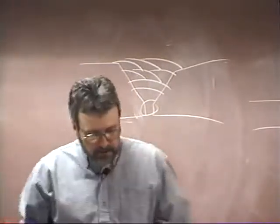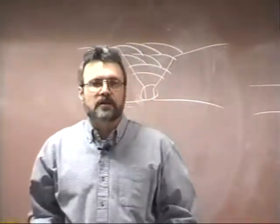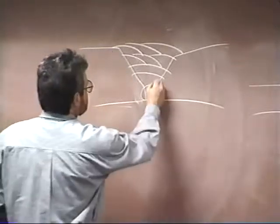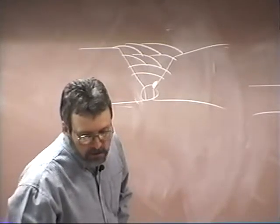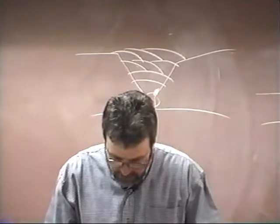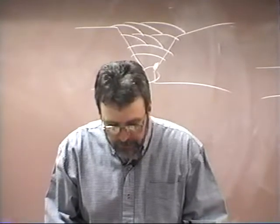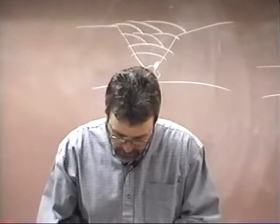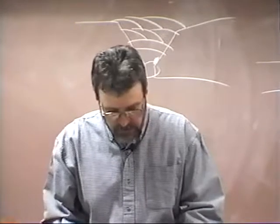Now the diagram that he's given us here was done to show certain discontinuities that can occur, such as lack of fusion, where you don't break it down and tie into all the surfaces, porosity, and slag inclusions. Those are some of the problems that you can have. So study that document or diagram, and some of the discontinuities that can occur here. And read that, because there's going to be two or three questions coming off of this topic titled Filler Passes and Their Sequences.